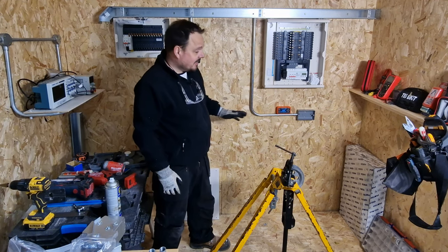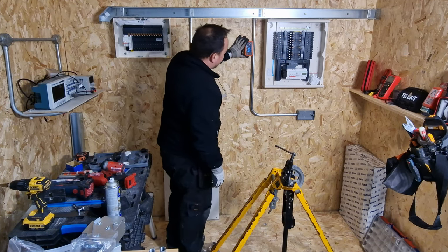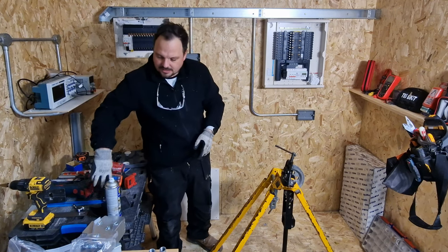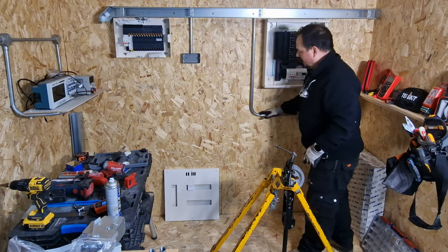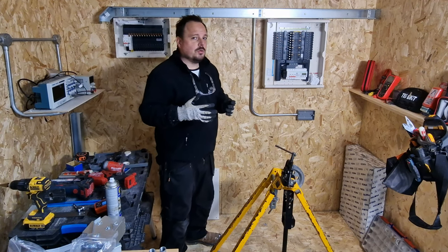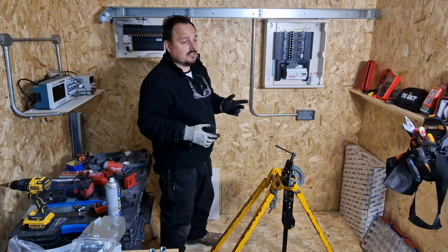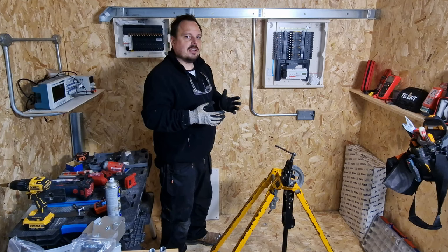You can see we've got it on zero degrees there, so that's a good indication that our bend is right on that plane. If we check across here, we're at 89.95 degrees - that's pretty close; just probably a bit of inaccuracy due to the saddles not being in place. Coming around this side, you can see we've got it fairly square and perpendicular to the board with a nice even gap. Sometimes what's square and true can look most out of place when working with things that are already there, so it's well worth checking the angles of things.